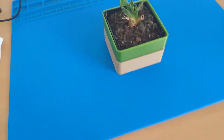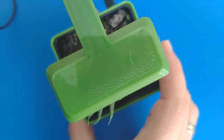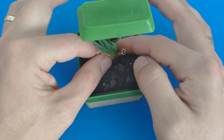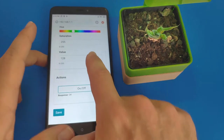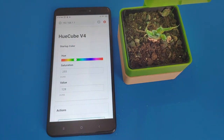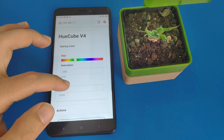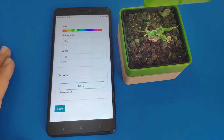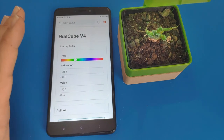This is how it looks when it's done. If we plug in the USB it's still working. It takes a few seconds to find the Wi-Fi, or if there's none it creates its own Wi-Fi, then turns on with the latest saved settings. This is a website I coded myself — I wrote my own code generator that generates all the configuration code and hosts this website entirely from the ESP. The phone is constantly complaining there's no internet connection because the CSS and JavaScript are provided by this device entirely on its own. I will create a separate video explaining how to do all the code stuff.